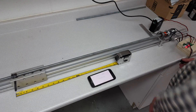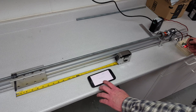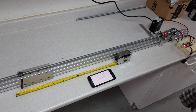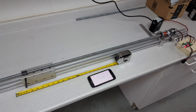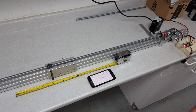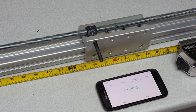Up to this point, I don't really have a lot of cutting and fabrication time. Before I start cutting into good parts and mounting things permanently, I decided to just do a quick mock-up on the bench to make sure that my calculations were right for the travel speeds for the linear bearing. I put the coupler on the end of the lead screw and then the other coupler on the motor, used cable ties to hold the motor onto the rail, and then temporarily wired the speed controller to the power supply and then the motor to the speed controller. Running at full speed in both directions of travel, I ended up with an actual speed of 14 inches per minute. This validated my earlier calculations, so now it's okay to go ahead and start actually cutting holes in my enclosure and mounting all the components.